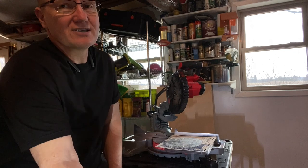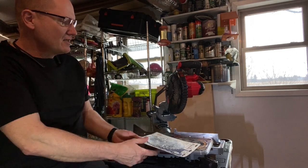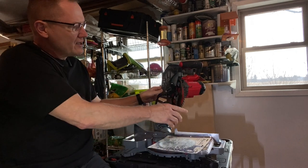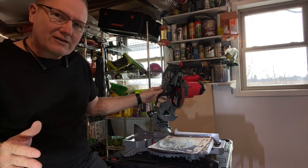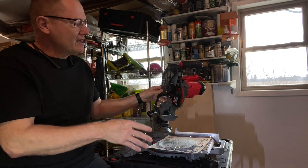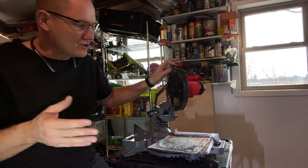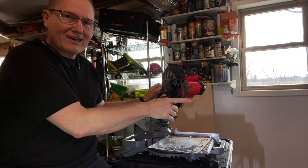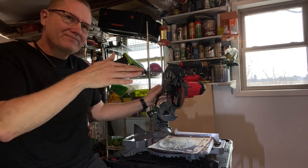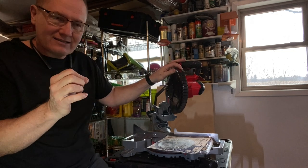This one I purchased but have not used yet because I've had smaller needs. Now this particular blade that's on here is a 7-1/4, but it's a 40T, which means that there's 40 teeth that go around this particular blade. That's a fairly fine tooth. The teeth on this are kind of a little bit smaller. This is going to give us the best crossover between speed of cut and fineness of cut.